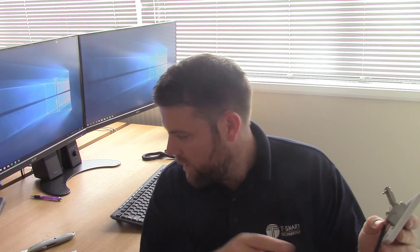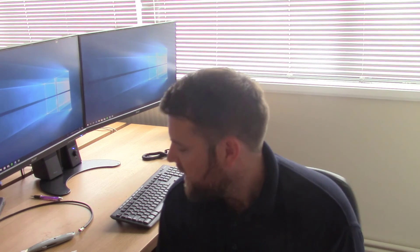And we're preparing the cables the same way. What I've got here is a little wall plate — this is a screened wall plate. If we open this up, we've got somewhere that we can push the cable up into. I've already loosened these screws off, and then we can tighten the screws, shut that, and tighten it up. When it's all nice and tight it's not going to go anywhere — it's going to make an okay connection, it's not bad. I certainly wouldn't want to do this normally, but like I said, I've had to do this myself in several situations where electricians have just installed the wrong cables.